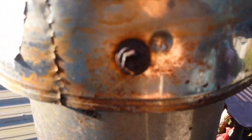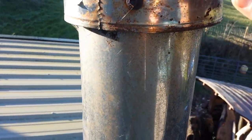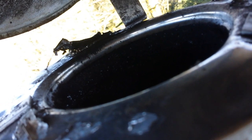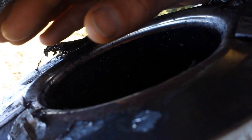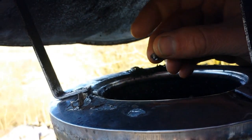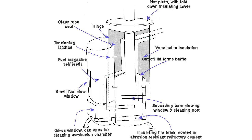Including the flue, it's all second-hand reclaimed stuff — none of this was new to begin with. Right now I'm just checking the air is coming out as it should. The fan's blowing up, it all seems to check out — I can feel a good breeze and things are blowing upwards. So somewhere between the burn unit and the chimney, something's going wrong. I'm suspecting the heat exchanger, but I haven't looked inside the burn unit for ages, so let's check that out.